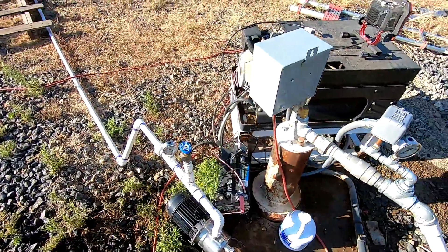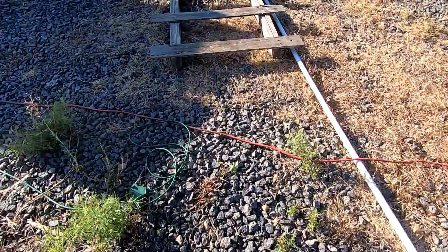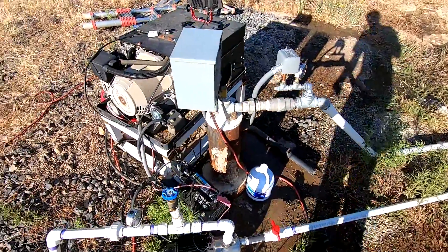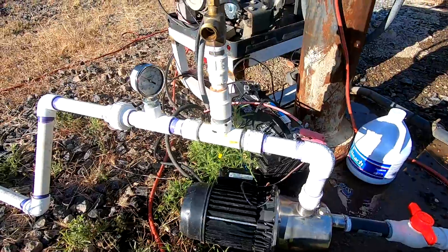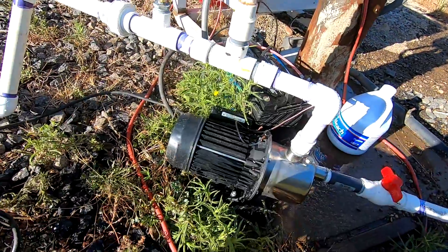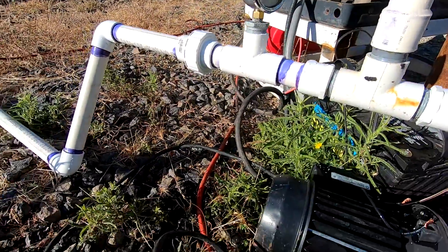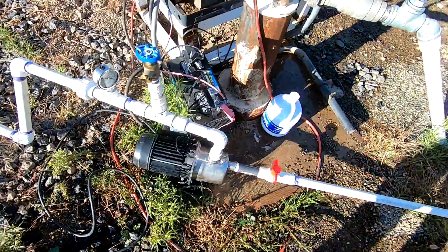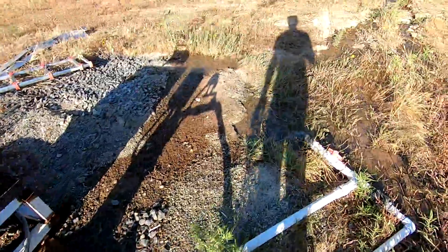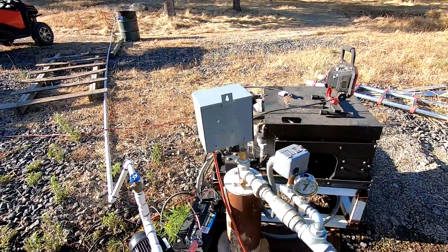The water line in the well is about 200 feet down. Now I'm going to plug in this one-inch sprinkler pump, purchased from Tractor Supply — this adds about 20 PSI of pressure. Keep in mind there still is pressure in the line, so it's a full pipe. Now I'm going to go ahead and open the valve and then close this valve so we should be sending water up the hill.